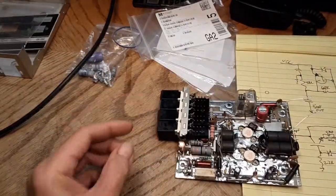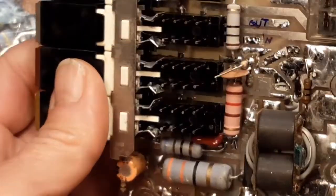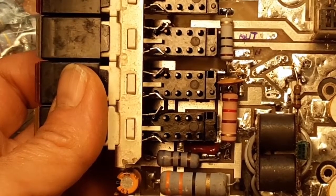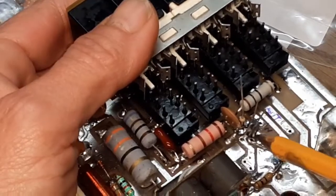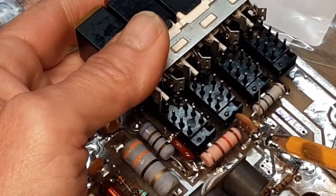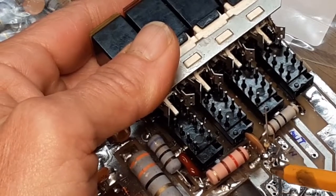I'm going to get everything out of the board and see what we can do. I got everything out and stood up a 100 ohm quarter watt right here at this connection point. Looking at the BF199 transistor, the pinout is C-E-B from left to right. To dead bug this in, the most logical position is facing this direction - the center connection bent over and down is going to be the emitter connection, which gets soldered in there.